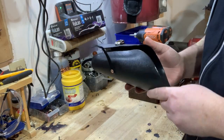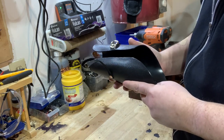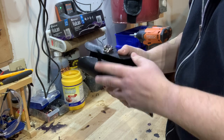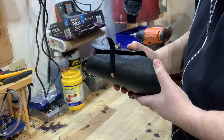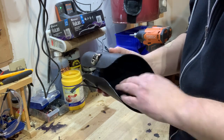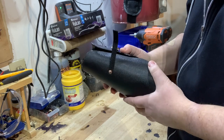Specifically what we're going to look at today is how to reshape these preformed pieces. We're going to use a little bit of heat — we're going to heat and hold it in the position it needs to be in, let it cool off, and it's going to hold its shape. This is the heat and bend method. The other method I use to shape plastic is vacuum forming, but for these simple one-way curves there's really no better way I know of.